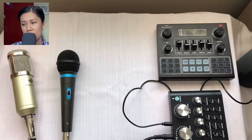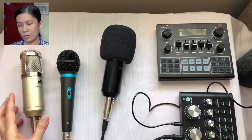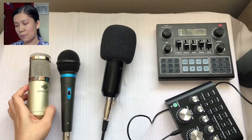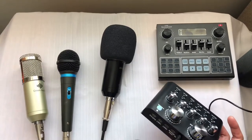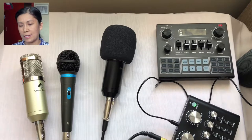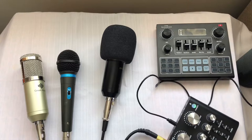Let's try the first condenser microphone — sound check, testing one two — okay that one is working. Now let's try the other condenser microphone plugged into the dynamic port. Sound check, testing one two — same result, it's not working with both connected. If I remove one condenser microphone, the remaining one works. So whether it's two condenser microphones or one condenser and one dynamic, you can only use one microphone at a time on the V8.